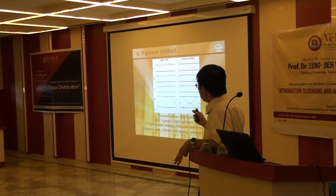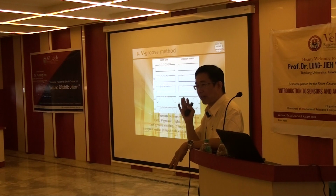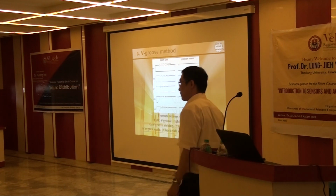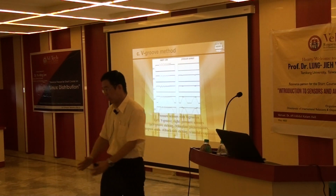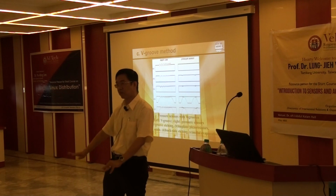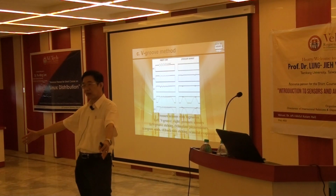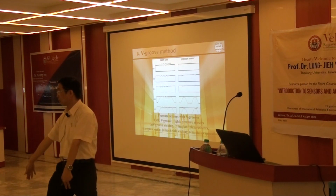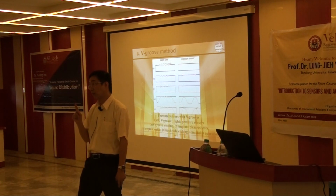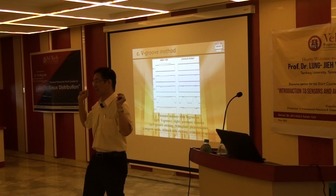The third method I mentioned here is not a control method, it's a measurement method for you to understand what the diaphragm thickness is. In other words, the perfect way. My perfect way is, okay, we have the etching solution beaker, very stable, very uniform. I have a whole lot of 25 wafers dipped into this etching solution, uniform. So we only do the time control.